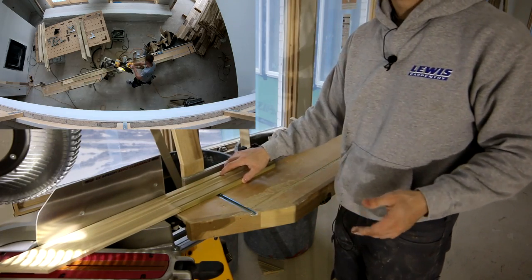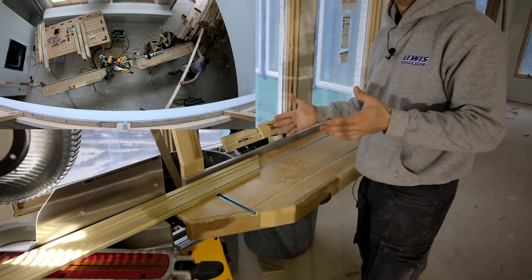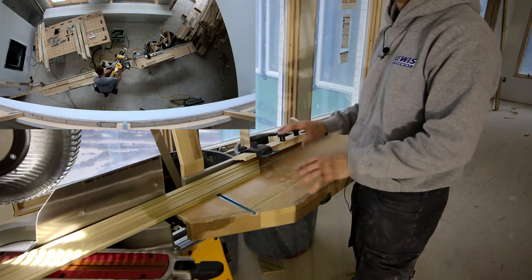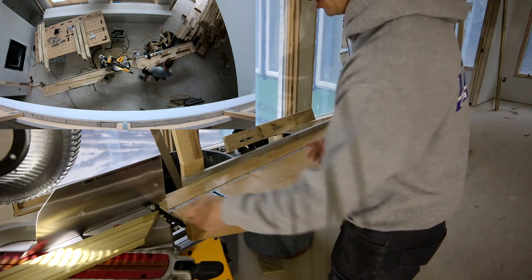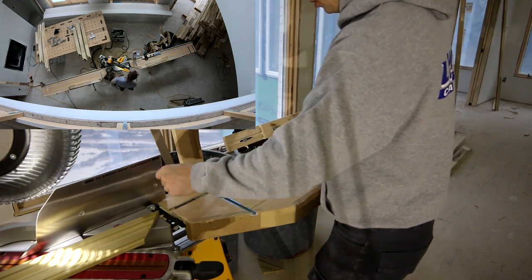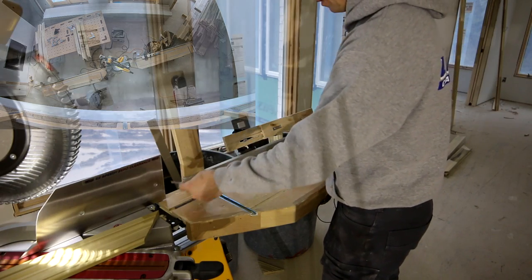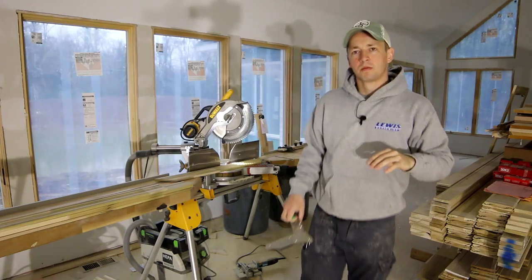I might have 16 different pieces and never have to pull out my tape measure — they're always exactly the same. I don't know why nobody makes this, but it's a huge profitability and efficiency booster. As for calibration, the tape rides on a piece of magnet. Anytime I put my wings on again, I always recalibrate the tape — you just pull it up and slide it back and forth to get it exactly where you need it. It's a really great system.